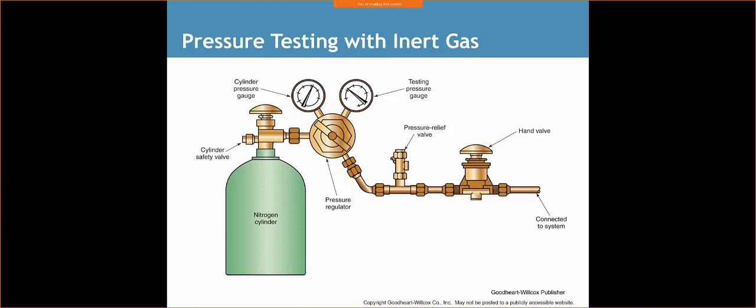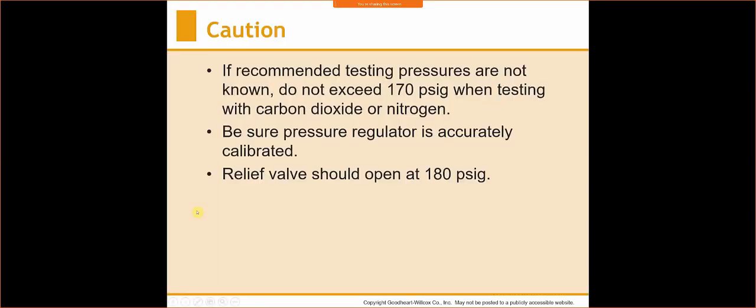All right, we're not going to exceed the recommended pressure by the manufacturer. The reason being, we may cause an explosion. The compressors are rated to a certain pressure. Anything above that may cause them to rupture. I would not want to be standing above a 600-pound burst or an 800-pound burst, whatever the case may be.